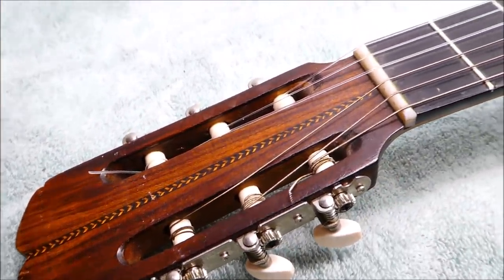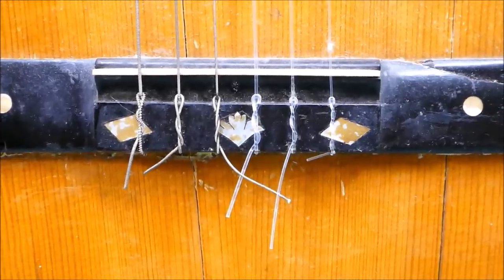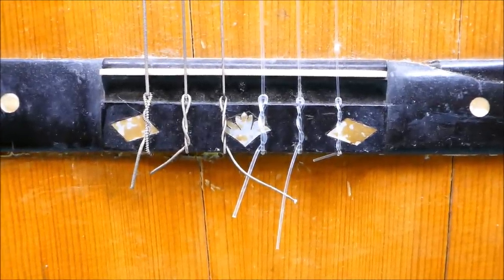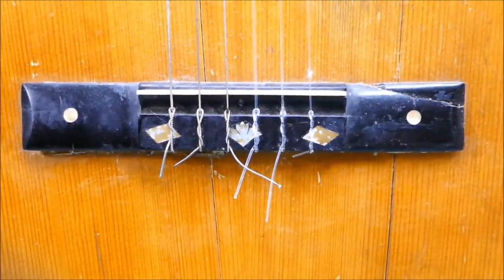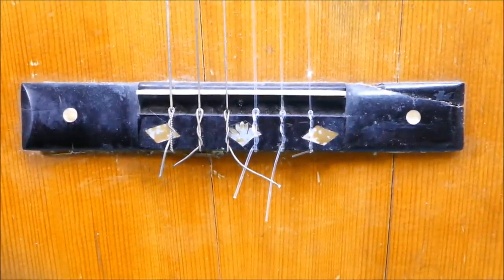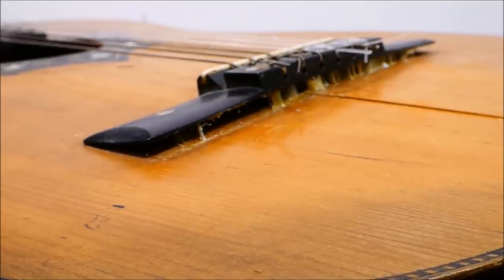There is one serious issue with importing Cuban woodwork to Canada, and that is humidity. This was probably born and raised in 70% humidity; once it comes north, cracks are almost inevitable. I've seen similar things happening with really nice guitars being made right now in Vietnam — they've got excellent shops there, but keeping the humidity under control is a losing battle. I've told people that if you order one, you have to keep it in the case with double humidifiers all the time just to keep it under control. It's the nature of wood.